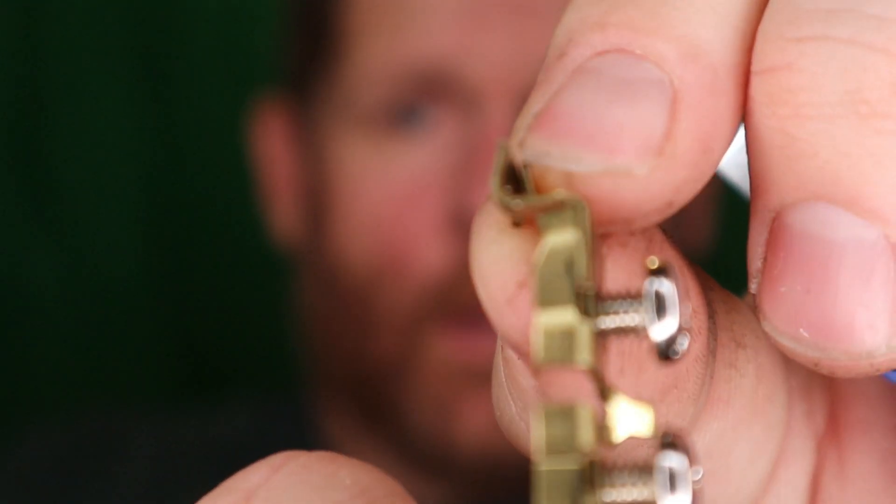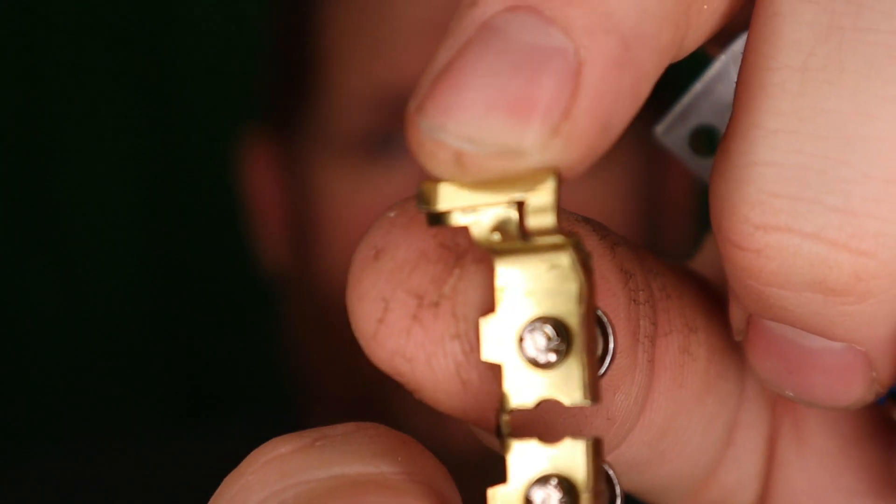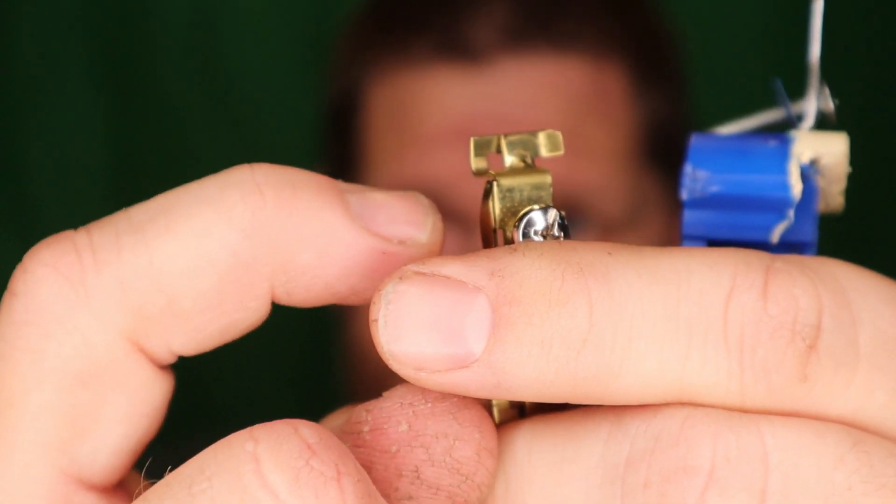I'm going to try to get my face out of the frame because it doesn't want to focus on this thing. As you can see, I'm going to put a piece of wire in here in a few minutes to show you. This right here is what you have — you can see how it's bent at about a 50-degree bend. What happens is when you push the wire into that little hole, it goes in and up under this little bent piece, and that is your tension. When you need to get it loose, you push your screwdriver on the flat spot, which pushes that bar back to release your wire. Eventually that is going to weaken — that's just the way it is. And that is the reason why I do not do it.